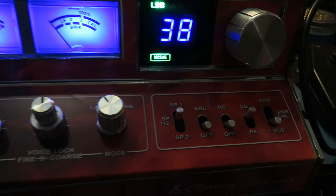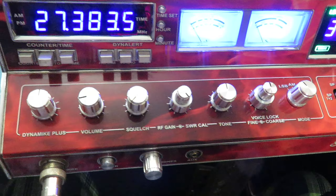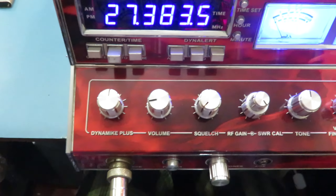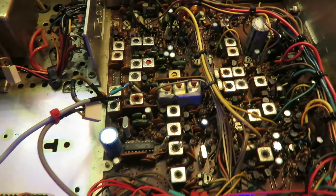You can see here all the components that I replaced. A couple of stuck old meters. We call these capacitors the '10-volt blues' — most of them are the blues, but they only use 10-volt caps in these, and really that was kind of cheaping out. So I replaced these caps with 25-volt new caps. This crystal here — usually these are good crystals, but age just took its toll. I had to put a new crystal in there to get the frequency to become stable.